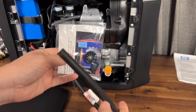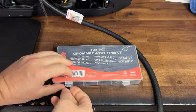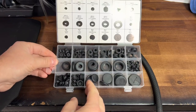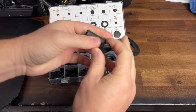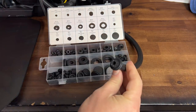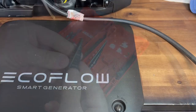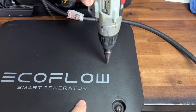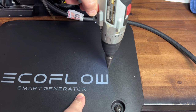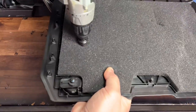They provide a through port but it's quite a bit bigger and made of plastic, so I'm going to use a half-inch rubber grommet instead from an assortment you can buy online — a little soap and water makes it slide right in. Step drills are definitely worth their weight in gold for this. I'll drill just past the half-inch line, do a couple test fits, then put in the grommet.